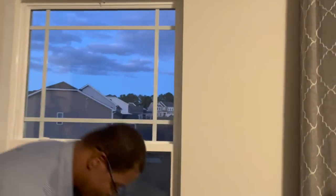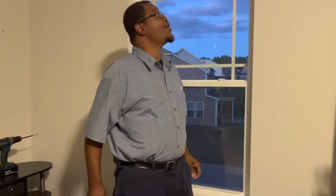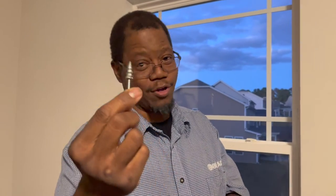Since it was just up with regular screws, they made the hole a little bit bigger. So what I'm going to do today is use these drywall anchors. They come in many different sizes for different weight capacities — this one holds 50 pounds. The curtain doesn't weigh that much, so I'm going to use these. I like them because they're self-tapping: you just put them in, screw them in, and you're done.